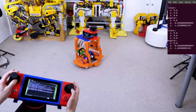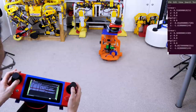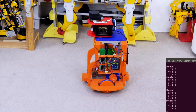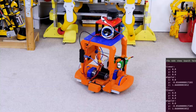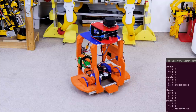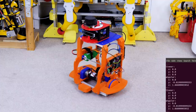So I've just recalibrated and recoded the Arduino. It's running completely open loop, but I roughly need to get the scale right, so when I say we're driving at 1 meter a second, it actually is driving at near 1 meter a second. We've got quite powerful motors and a battery that can source lots of current, so there's not really any issues with just scaling the PWM fed into the motor drivers directly from the command velocity topic and the twist message it sends to drive the robot at particular speeds and make it rotate at particular speeds.